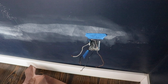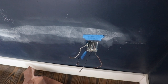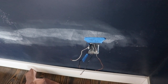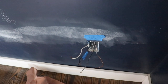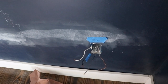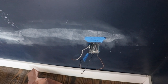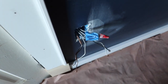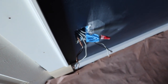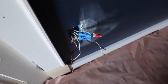So make sure, if you're doing some of your electrical, or the electrician's doing some of the electrical, a lot of this is just sloppy electrician work, because they would have been wasting time later trying to trace this stuff down. Make sure that your labels are being left on when they strip them back, like I showed you with that home run wire. You can see on all of these, they're coming back through and relabeling them. When I wired these, I made a specific point to label all of these.